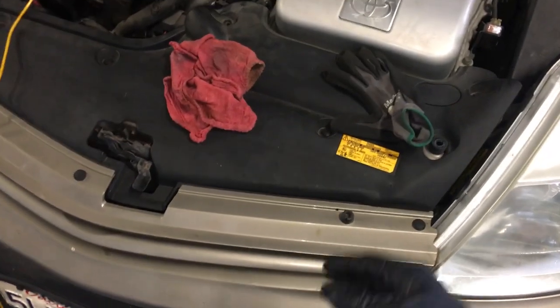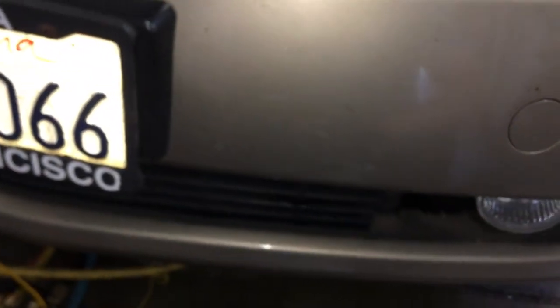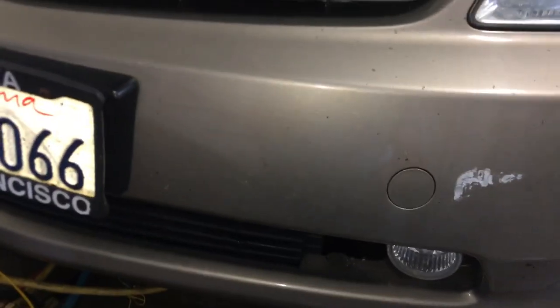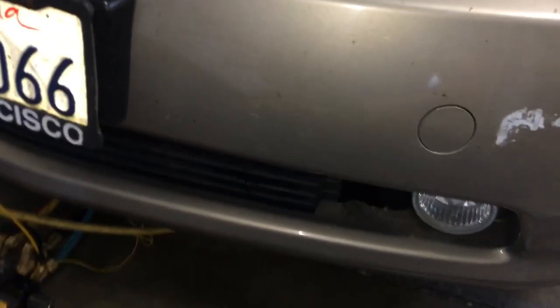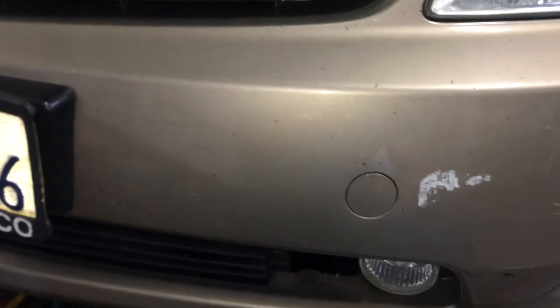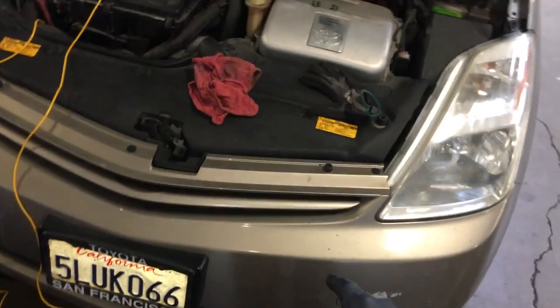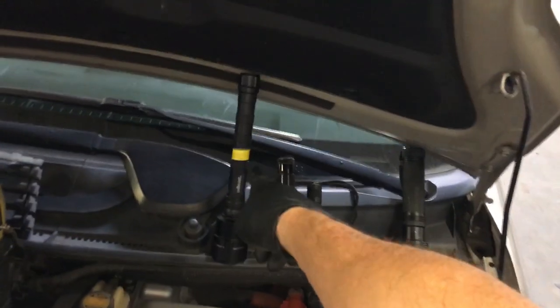It can open up, and this could be one of those ones where you go a few weeks, a few months, or he calls back tomorrow and it's completely empty. Now, this is what makes it hard. Since this is a water-soluble dye, if you have one of those customers who goes through a lot of car washes, or it's wintertime and the leak developed while it was raining — the rain, the fog, the sleet would wash all that oil away because it's ester oil and it washes away pretty well with water. So when it comes to your shop in the springtime or summer, it's already run out of refrigerant and there could be no oil stain, no dust pickup, and you would have a clean condenser and would never know that was a leak site.